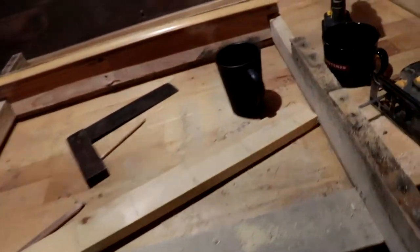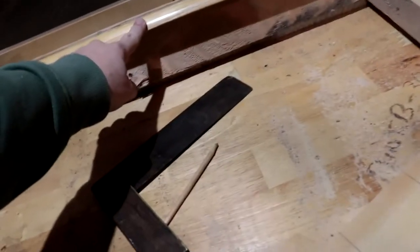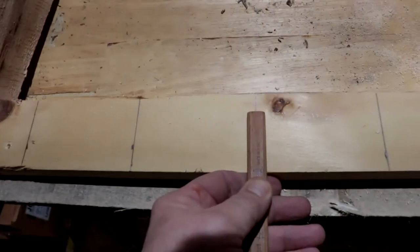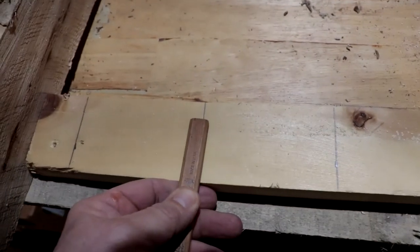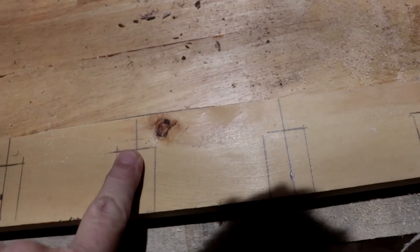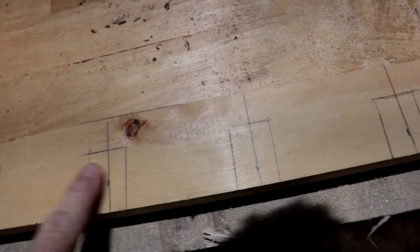Never mind the coffee — you don't do anything without coffee. That's the bottom; the rods come up this way. This piece here has got to have some slots cut in it every four inches, so I'm gonna use a pencil on each one, trace it out, and then use a jigsaw to cut it out. As my luck would go, the pencil wasn't wide enough so I ended up using a chisel, and there you see we have the center line for each one — they're all the same distance in.